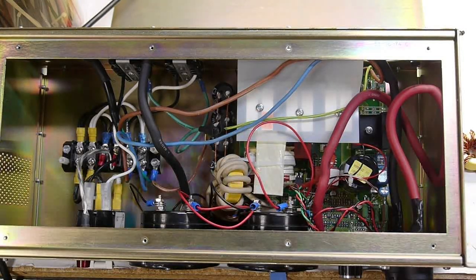When I first took this up to the arc lamp the lamp visibly flickered — not at 60 Hz, but like a wild arc with a lot of high frequency in it, which is exactly what it had. The switching frequency is around 20 kilohertz. The capacitors actually worked very well, and I put a whole bank of them together, so there's a huge amount of energy storage there.